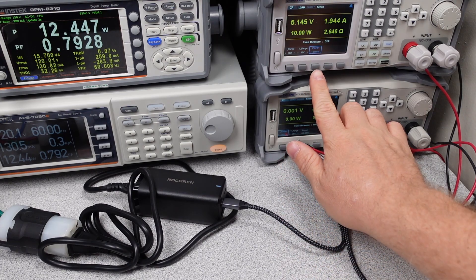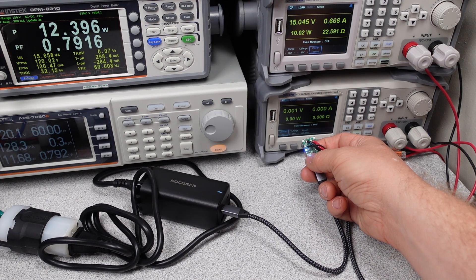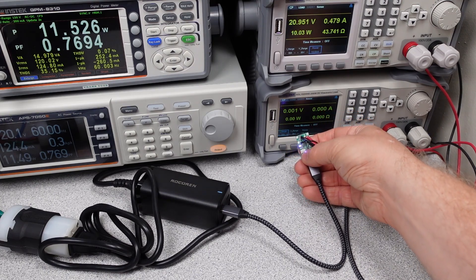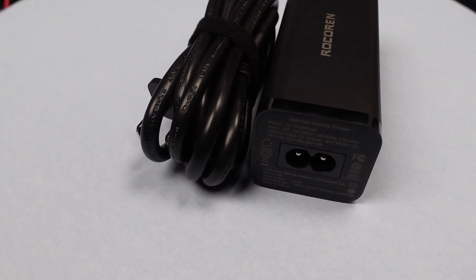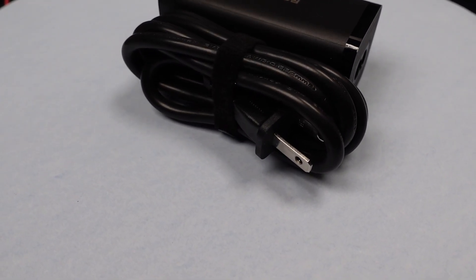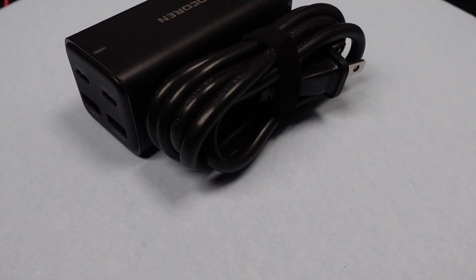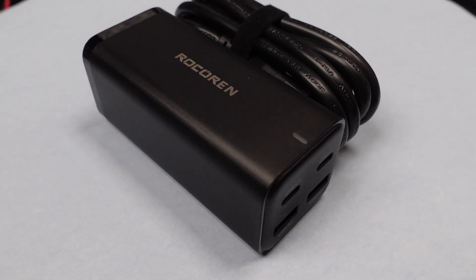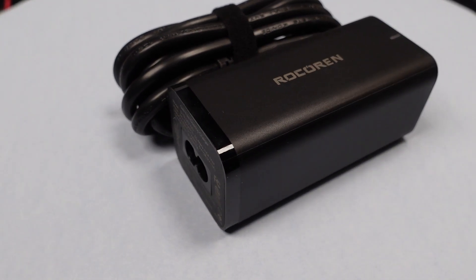For modes of operation, this adapter has 5, 9, 12, 15, and 20 volt fixed USB 3.1 power delivery modes on the USB-C ports. The USB-A ports support QC with one port used, then 5 volts and 3 amps shared. The power adapter also has a programmable power supply mode at 21 volts and can go up to 5 amps, so this might be a good option for Samsung's super-fast charging. I checked both USB-C ports in PPS and this charger does support two PPS devices at once; however, the voltage drops to 11 volts and it only supports 25 watts per port. Any plug or unplug causes a renegotiation of all the outputs.